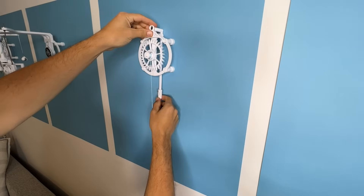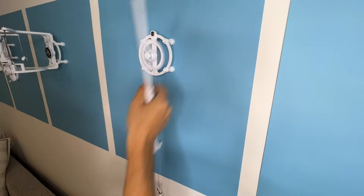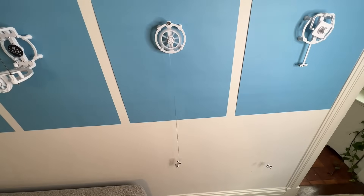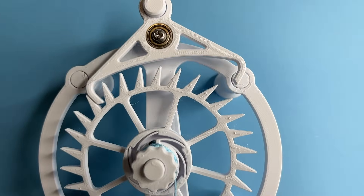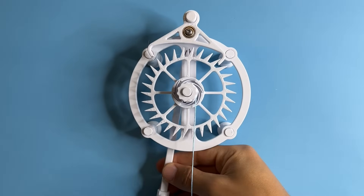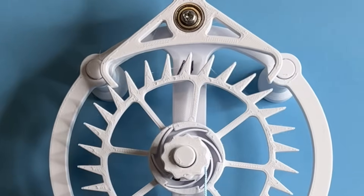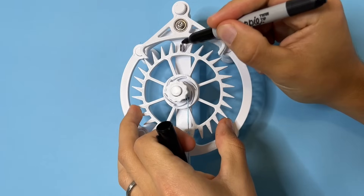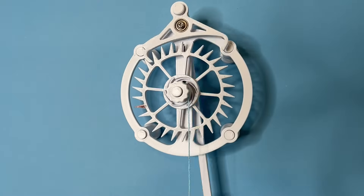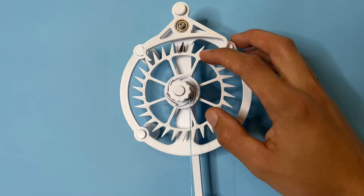Remember how I said that was important? If we remove the anchor and the pendulum, the energy gets released quickly — or in scientific terms, it gets converted to kinetic energy and heat. The escapement wheel also transfers energy from the weight through the anchor into the pendulum to keep it swinging. Each full swing advances the escapement wheel by one tooth, and there are 30 teeth on the wheel. To measure one minute, we just count one revolution of the escapement wheel — and boom, we're keeping time.